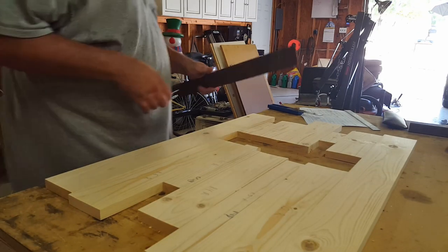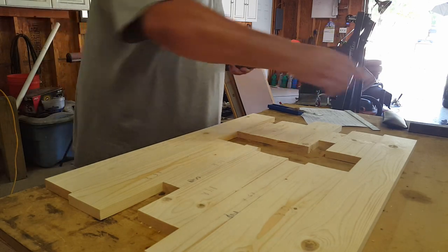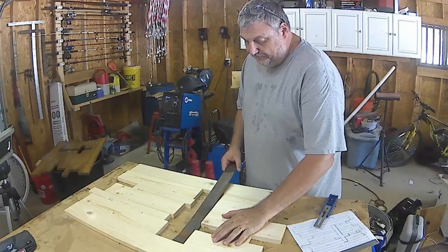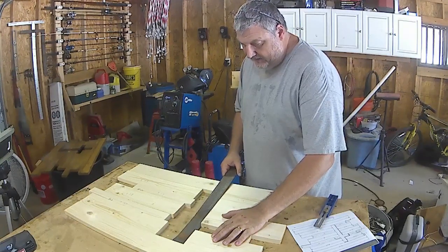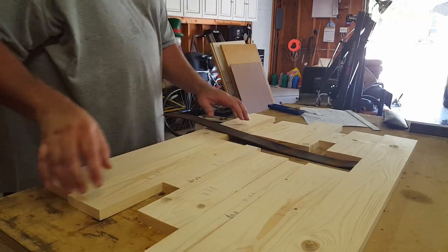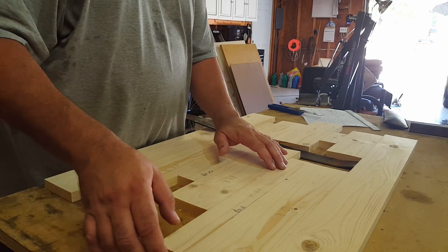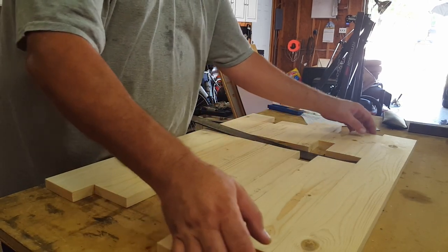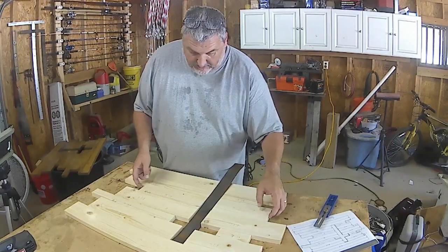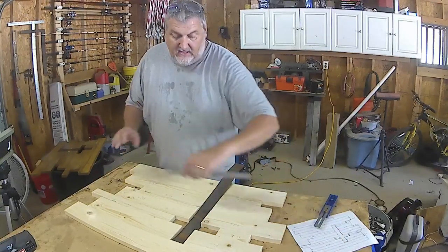Okay, and I happen to have a piece of the 2-inch flat bar that I used for the crosses. That's actually what I used on the ones that I made for the show, was I put a piece of this stuff in there, just a pre-made cross already. So now, if you have something like this, you don't even really have to measure on this side. You just scoot everything in till it hits that cross, or that side, right? And now you've got everything nice and lined up for that. Then you just measure this one piece and that's it.